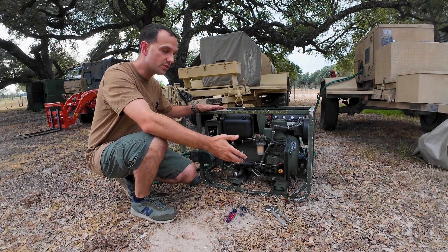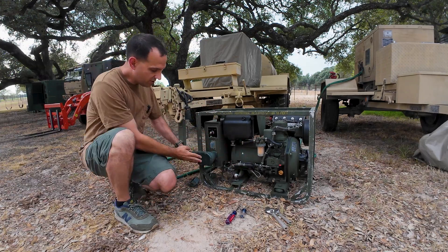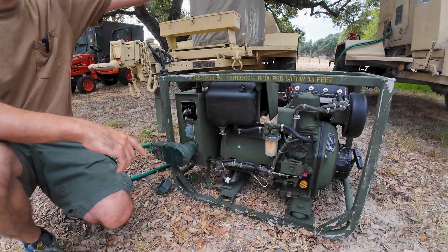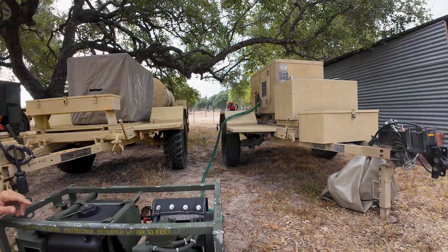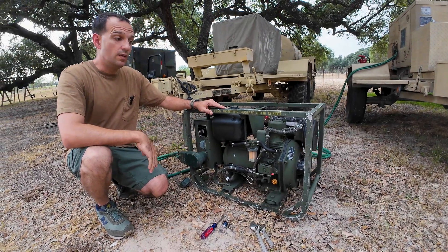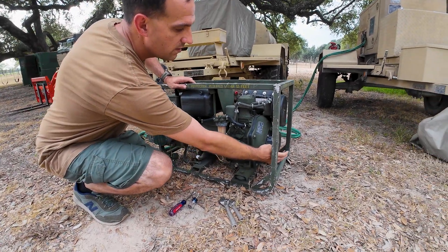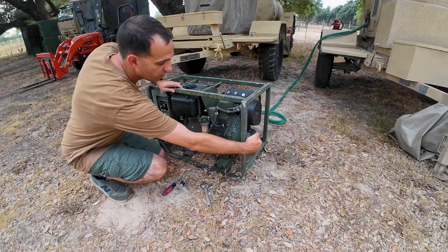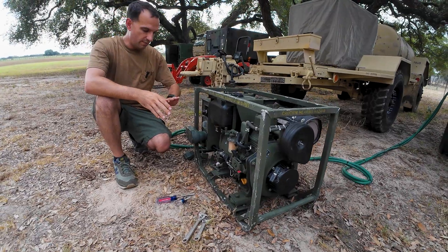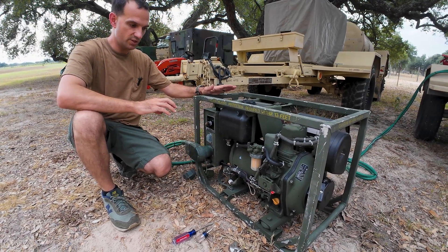The reason why I wanted to talk about priming this system is if you're unfamiliar with it, it could be a real pain in the butt. I have a slave cable hooked up so I can use the electric start portion hooked up to my MEP 802 Alpha. Highly recommend using the electric start to get this primed, because if you're trying to pull-start this you can be really strong. You can get away with putting a drill on that nut, but then you risk the nut coming loose. I recommend finding a way — even if you have to hook up 28 volts — to use the electric start.